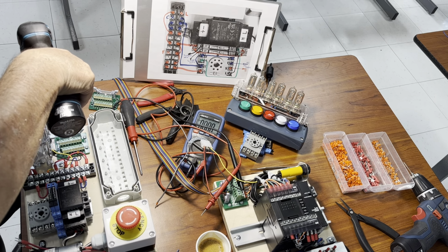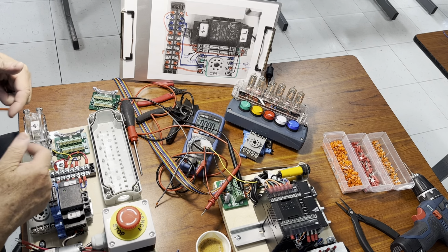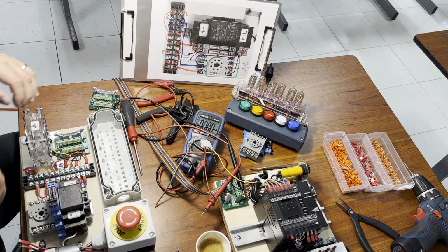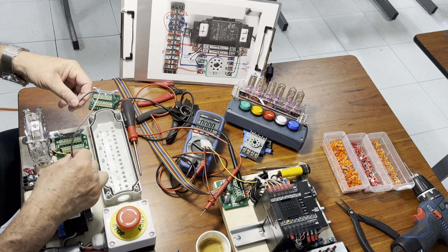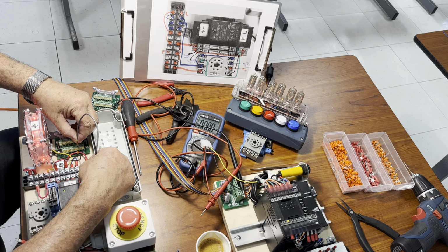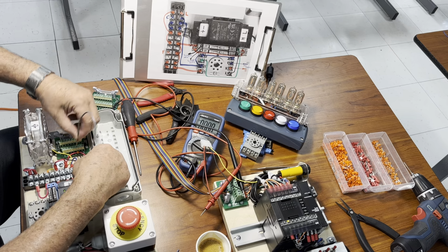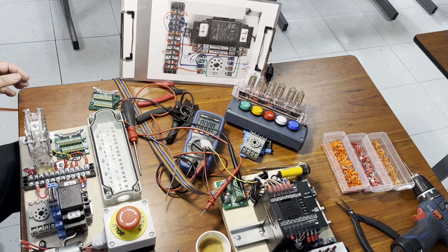You also remember that we checked in the video 13 that the fan has to respect a certain position because we want the airflow to go out of our trainer. So I can give it one more check if you want to. Okay. We pick up the wire, now the fan being in place. I catch any negative of the supply, pin 11. You see the fan goes on and the LED is mounted on it. They say the fan is turning. Okay. Put the power supply off. Okay. So that's how we checked our fan working, okay?